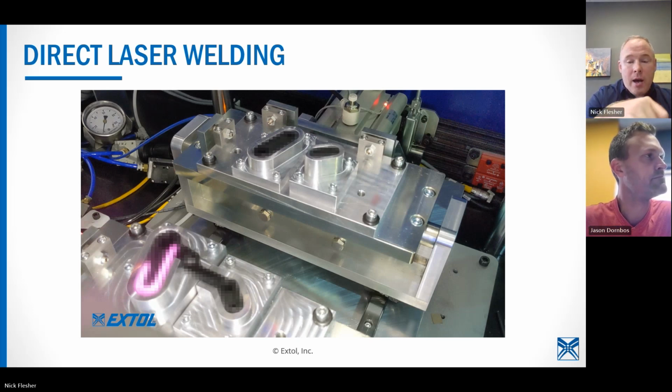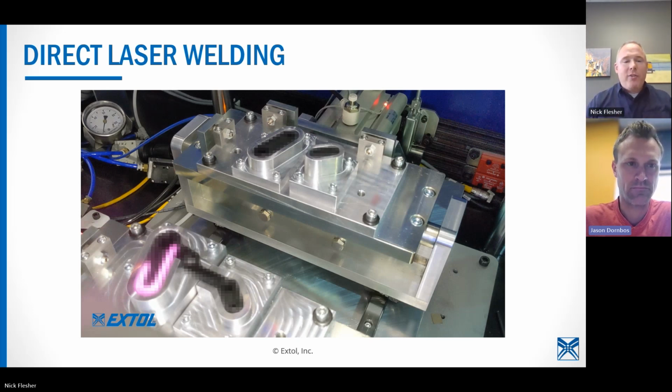I would say plastic degradation is typically caused by oxidation. So you want to make sure you don't overcook. If you think in terms of cooking the plastic, you want to apply just the right amount of heat to get the plastics semi-molten, not liquidy, not overheated, and not oxidized. Those are the things that you want to do.